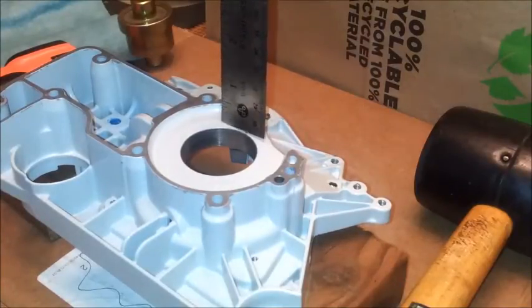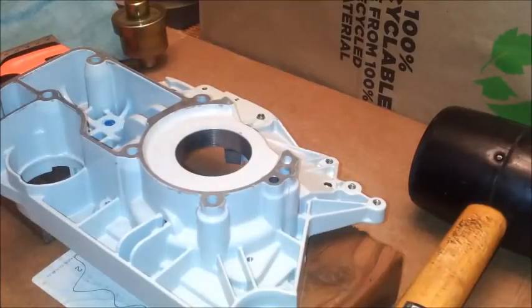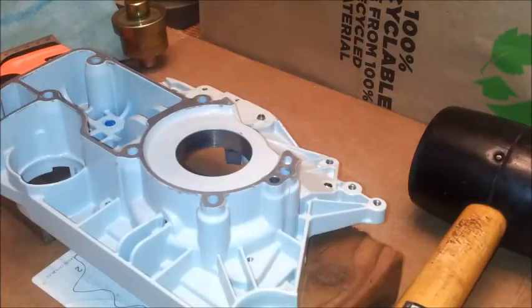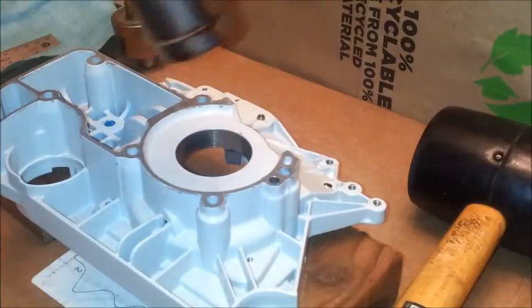I'm going to do what I can to keep it about 6 inches from the surface. And this isn't quick. The case is made out of magnesium, but there's a coating on it, so we don't want to blister it. The race shows 146 degrees, this area around the inside there.